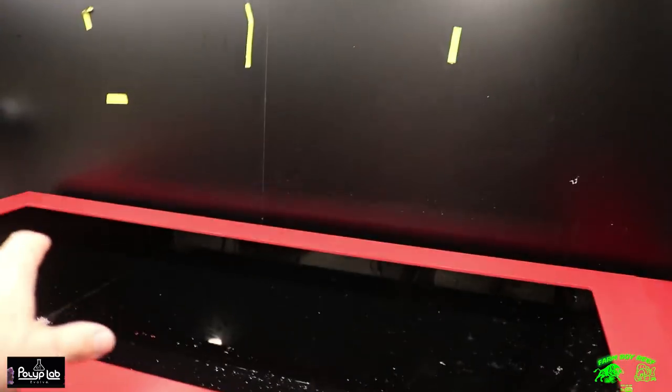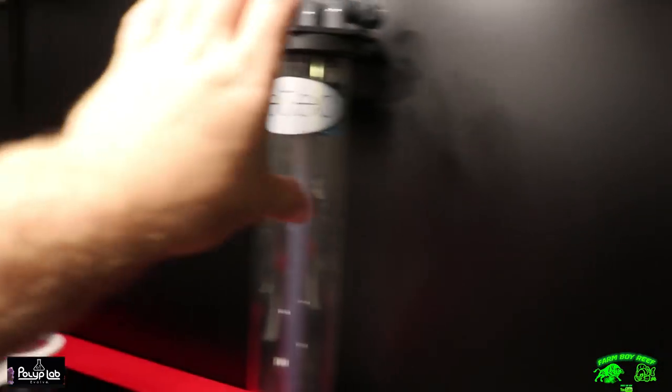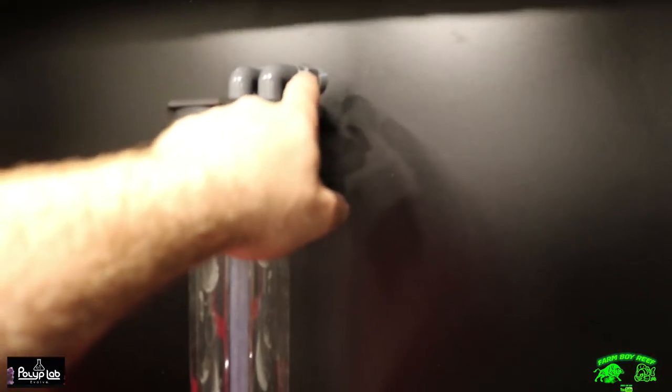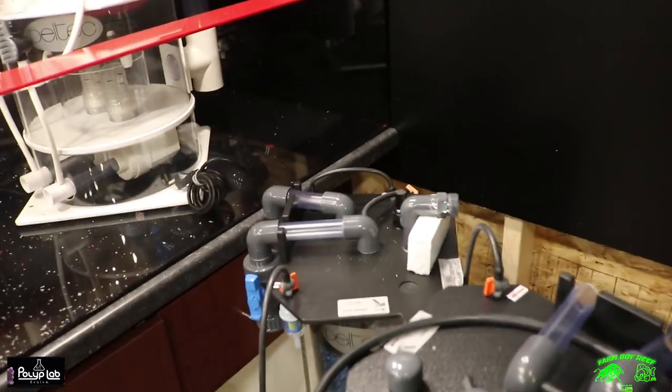And like I said, I'm gonna bring another pipe off of the Abyzz pump just to feed all the reactors over here. So we're gonna come around behind and I'm gonna build a header here with a whole bunch of ball valves, so for maintenance I can shut things off. And then I'm gonna hard plumb all of these as well. I don't wanna have any rubber tubing at all. So right here, I'll just have to build a stand for all these reactors.